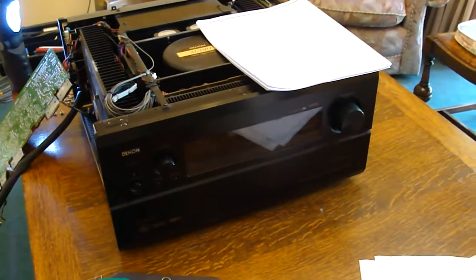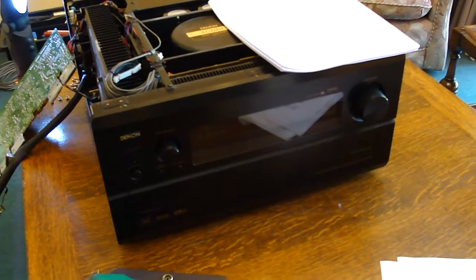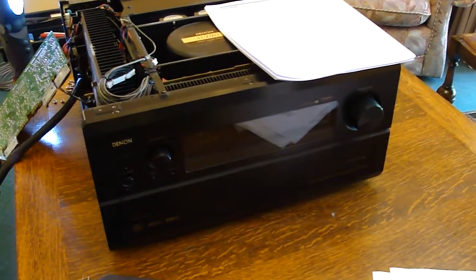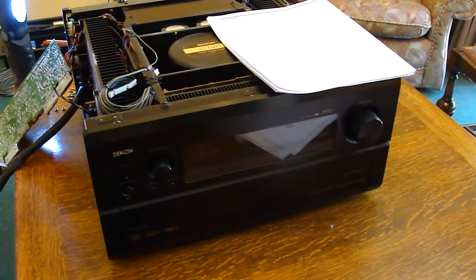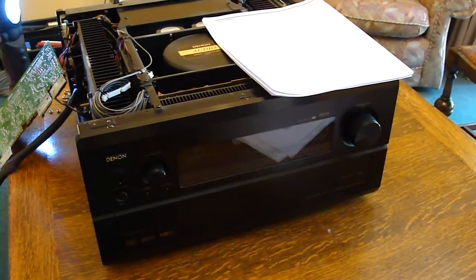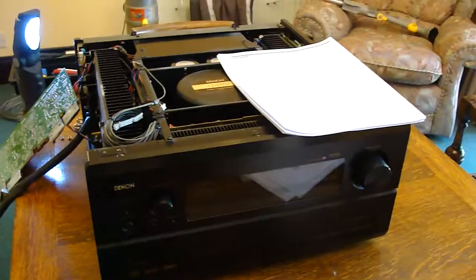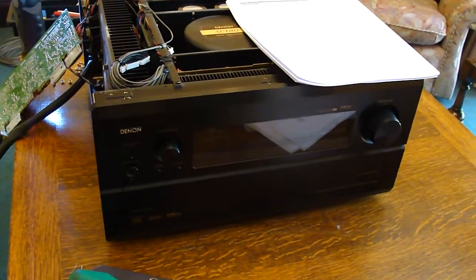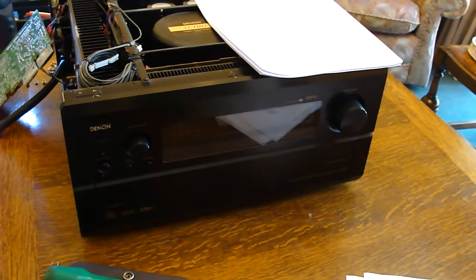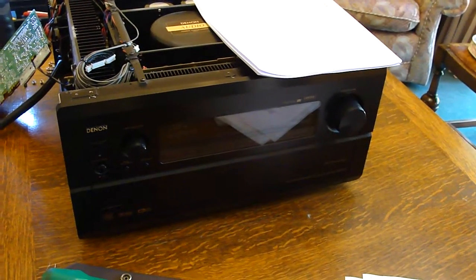This is a short video I've made to help other folks out. Here's my beloved Denon AVC A1SE surround sound amplifier. It's been working beautifully for years and then all of a sudden I was listening to it and I heard a crackling noise from one of the rear channels and then the sound stopped completely. The amplifier turned off and the red power indicator on the front started flashing. If you recycle the power, the main display comes up for a few seconds, seems to go through some internal self-checks, and then switches off and again the LED starts flashing.